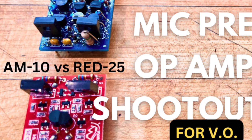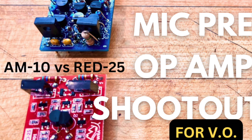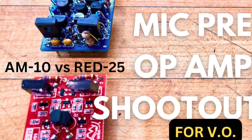The frequency response of your signal — it could tailor your frequency response. Some of them, like the RED25 op-amp that is currently in the CP5 right now that you're listening to, will emphasize the mid-range. Op-amps also basically tailor how your preamp handles transients — those sharp, short bursts of sound, like when a drum hit. That's a sharp onset of sound. An op-amp like the RED25 will enhance the punch and the snap of that transient response, so it feels punchy. Op-amps will also influence the preamp's headroom, which is the maximum amount of signal that the preamp can handle before it goes into distortion.